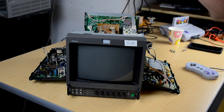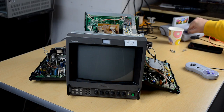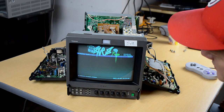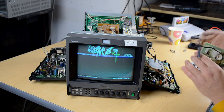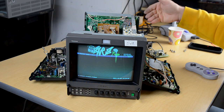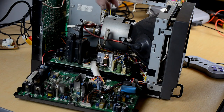First I want to test the power — it's plugged into the AC power supply and we have normal power up. Let's turn on our console and see — no, the red color is still out. So it's not the neck board; there's no problem with either neck board. It still looks like a tube swap is needed here, but the power supply switch is working and that's good. We just need to get that other tube in here.